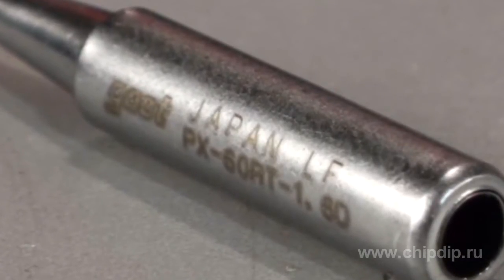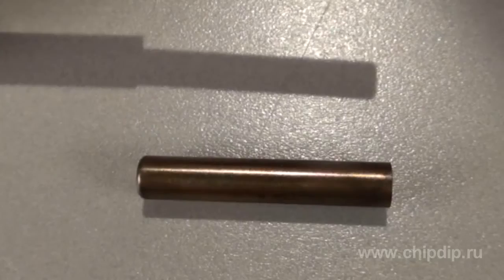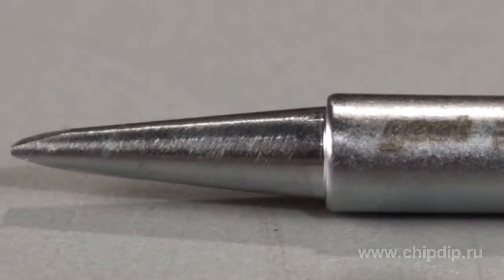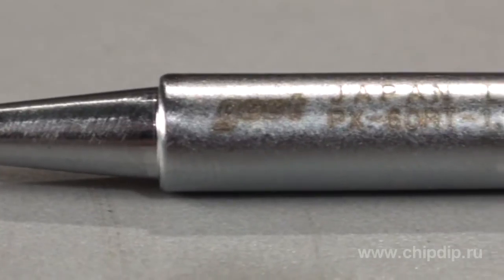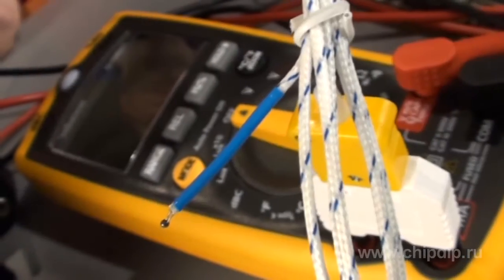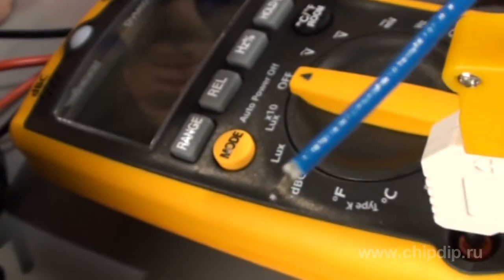There are 16 types of tips. The tips come with a built-in heat-resistant steel sleeve, which protects them against sticking to the heater. The authenticity of soldering tips is verified by laser engraving. If you need to replace the tip or the heater, the temperature can be adjusted with the help of temperature control devices — more specifically the CAL potentiometers located on the front panel of the station — and the thermocouple supplied with most multimeters.